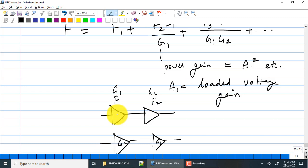What really matters is the available voltage, because many of the circuits that we are building will be common source or common gate circuits, for example, where the input voltage signal is applied across the gate-source of a transistor. In that case, for many MOSFET circuits, you are only interested in the absolute voltage. If you have the distributed effect, then you will have a standing wave, and much of the voltage may be reflected back. But if they are very close by, you can directly assume that they are cascaded. You are not interested in matching.